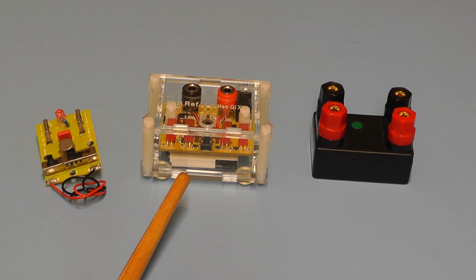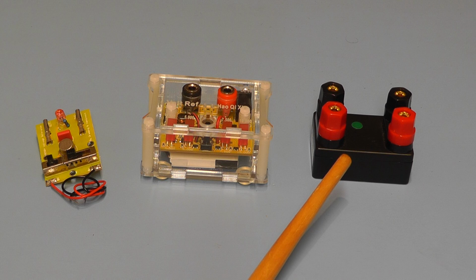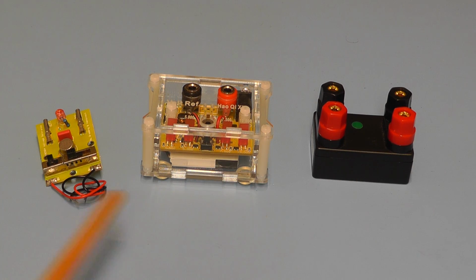Also, both these two units can give you reference voltages ranging from 2.5 up to 10 volts in 4 steps. So that's 2.5 volts, 5 volts, 7.5 volts and 10 volts as a reference standard. The unit on the right is a 10 volt reference standard only. This one tends to use either a Texas Instruments IC or a Linear Technology IC, and it's just in a 10 volt version, but these tend to be more accurate than the previous two. As a result of that, the one on the right is by far the most expensive, and that can vary in price from around £40 to £65 depending on the tolerance. Well, let's have a look at each of these items in turn, and I'll start with the simplest one, this one here on the left.